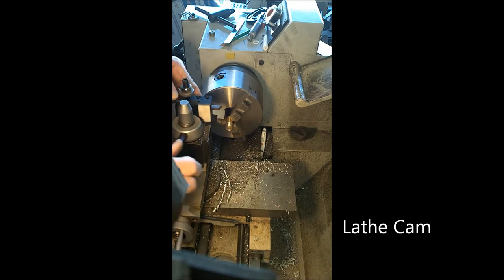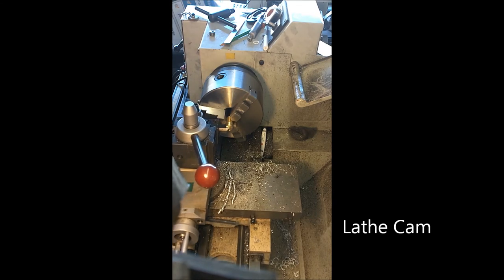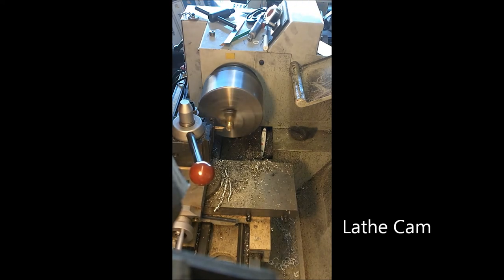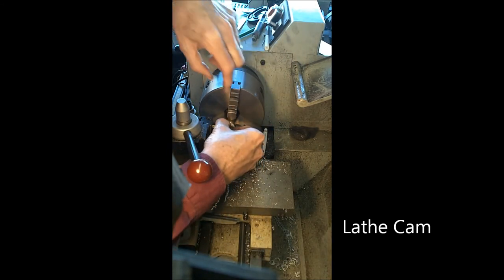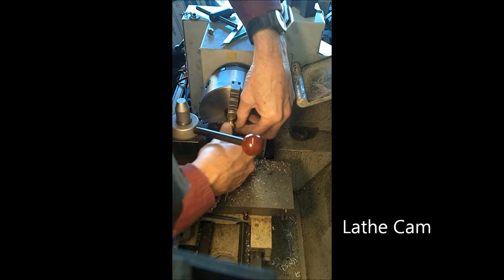I've gone back and this time I've ground a square bit to see if I can make that groove. These grooves are pretty tiny, so that's one reason why I'm having a little bit of difficulty here. Let me make sure I've got this on center — yep, that's on center. Now let's try this. Okay, that's one ring groove done. Let's see if we've got enough for two rings here. Fits good. Okay, I've got that done.